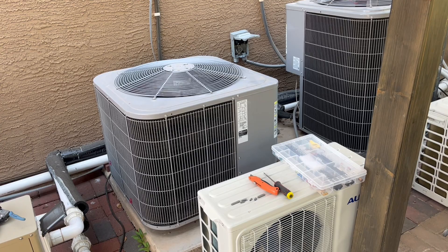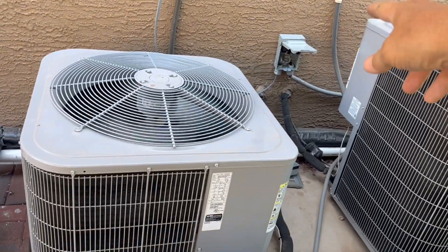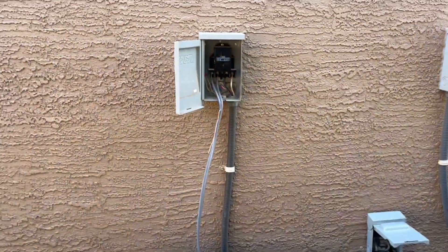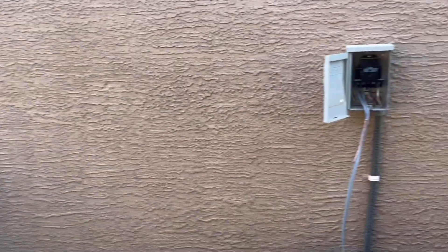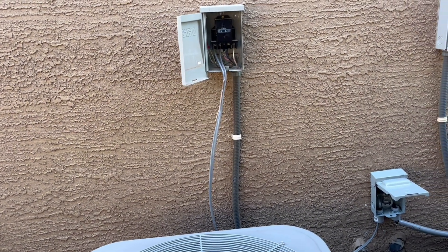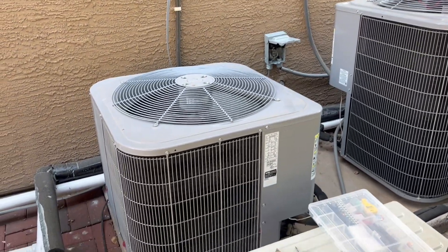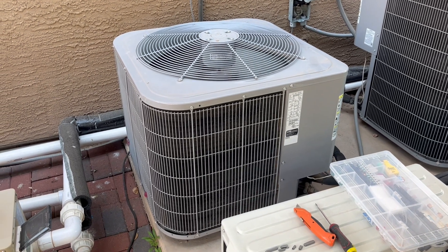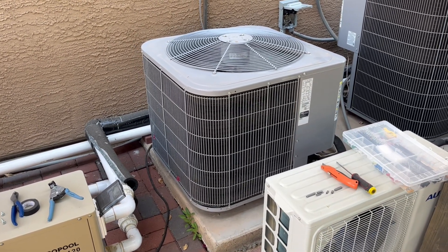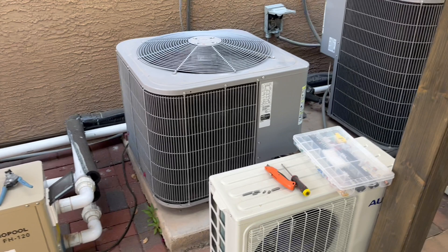I'll need to wire it so I can come out here, pull the fuse on the grid disconnect, pull the fuse on this one, turn the breaker on, and run it off the grid if needed — so I can run it either way. I'm really excited. A year and a half ago I wanted the 6 kilowatt Growatt, but the 12 kilowatt is definitely going to be able to fire this beast up now that I fixed the voltage setting.